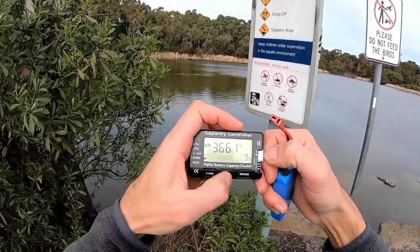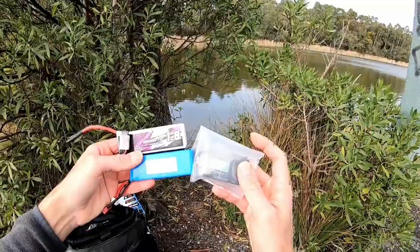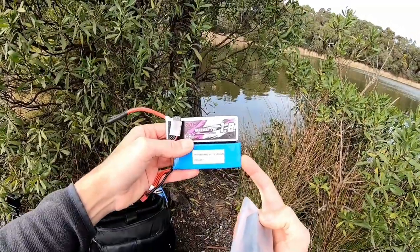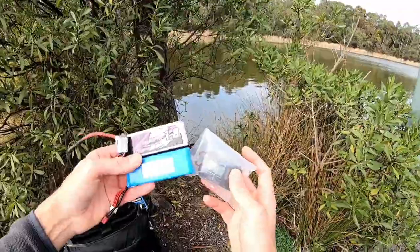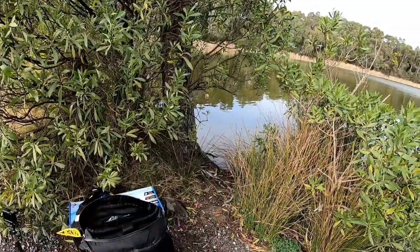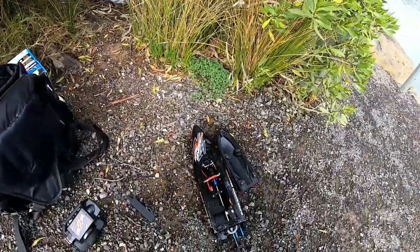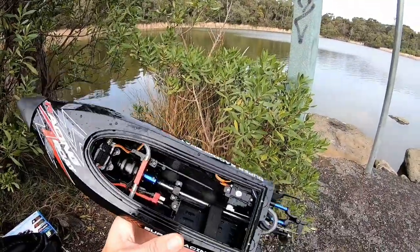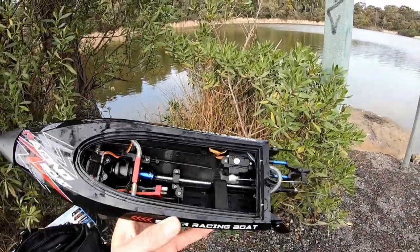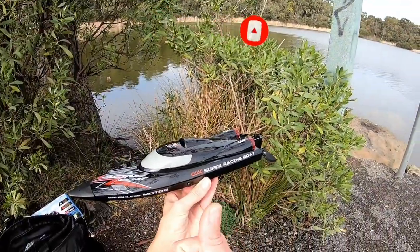Seven percent — 3.6, 3.6, 3.4 volts. That's a little low but still not too bad, I'm happy with that. The stock battery got around 42 to 43 kilometers an hour, and 46 on the China Hobbies 70C battery — so the stock 45C battery is pretty good quality. I'm going to have to chuck a 4S battery in to see if we can get the box-claimed 55 km/h. I need to buy a 4S that fits because I don't have one, but I'm keen to do that. A little bit of water in there — definitely never run a battery that doesn't fit. All right guys, I'm going to leave it here — cheers, catch you in the next video, stay safe!